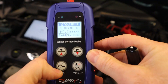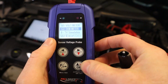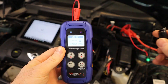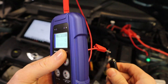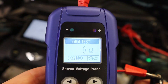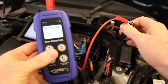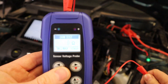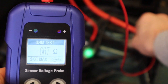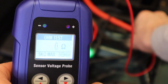The other setting is the ohmmeter mode. Going back to the function button, press down to select ohmmeter and you get the ohmmeter display. Joining the two wires together shows zero ohms — that's the remote ground lead on the bottom connected directly to the top of the probe. It will also measure resistances directly to ground; putting the probe lead onto the ground shows zero ohms.